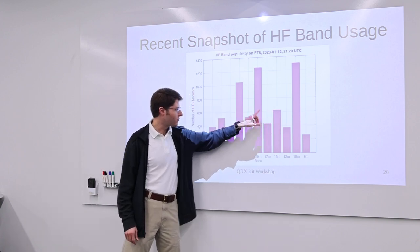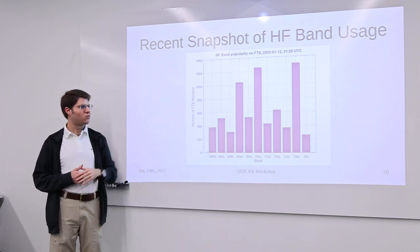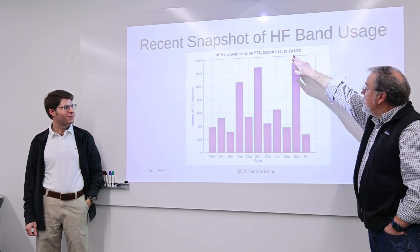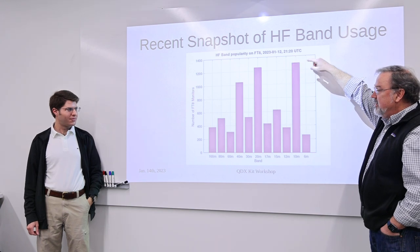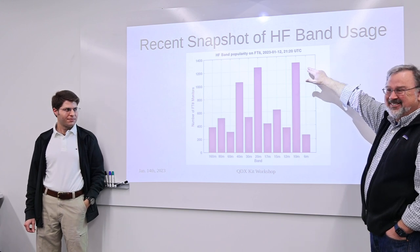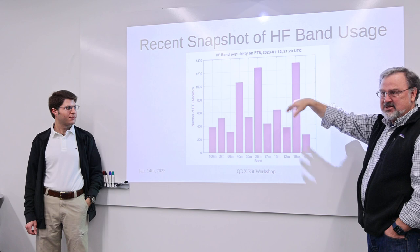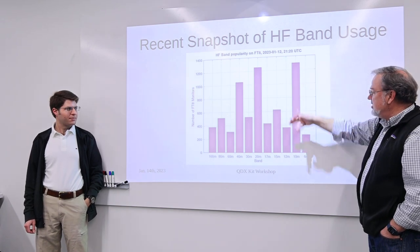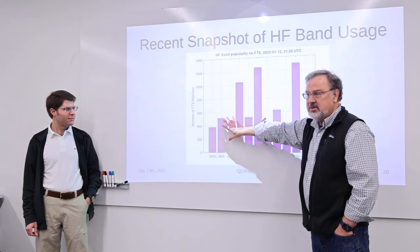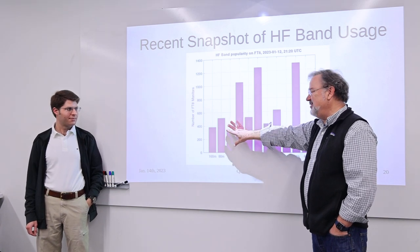That's why it's good to know which bands are most popular — once you build your kit, you'll need an antenna. The dipole antenna consists of two lengths of wire attached to your radio — the total wire length is half a wavelength (lambda over 2). Cutting the wire to that length makes it resonant with a standing wave half a wavelength long. If you cut it to a different length, you shift the resonant frequency. You need to know ahead of time what band you want to use so you cut your wire to the right length.